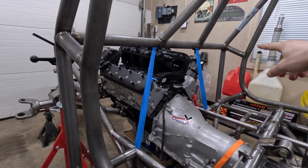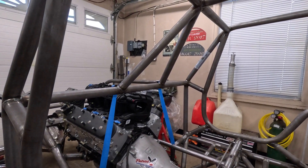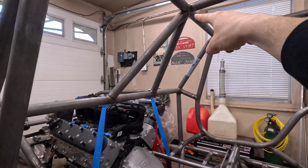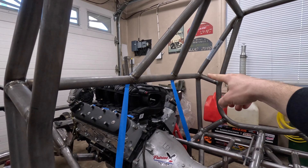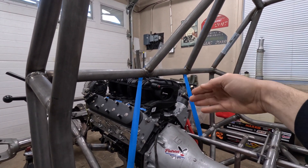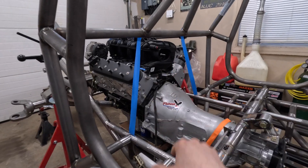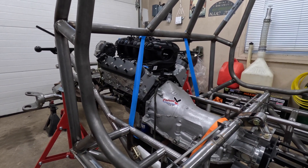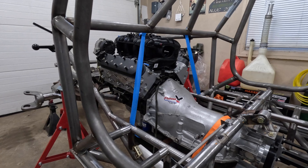This will also give the chassis a little more support on the dash bar area. If I were to do a flop or a roll and pressure from the top of the cage came down, all that pressure would transfer through to these V-bars and stop there — otherwise I could potentially tweak out the dash bar. So I'm going to get these tubes put in, and if everything clears we'll continue on, otherwise it's back to the drawing board.